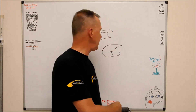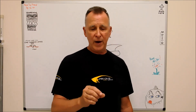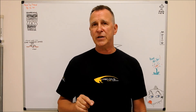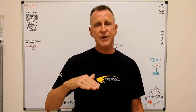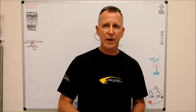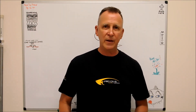This is really hard to do — really hard to form a chip like this if you're just using a smooth tip tool. But if you have a Dremel tool, a die grinder, or little hand stones, you can actually grind your own chip breakers into the top of a high speed tool and be very successful with the chip it forms. I'm going to show you a commercial TPG holder that has a built-in chip breaker insert topper on it, and a high speed tool that I ground. We're going to turn the lathe on and make them both pop out C's and 6's right before your eyes.